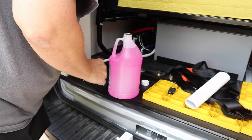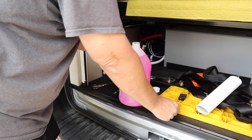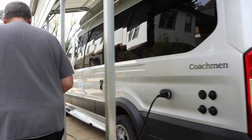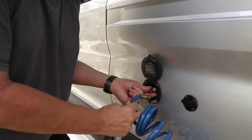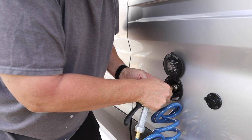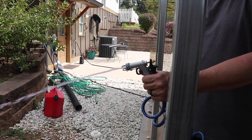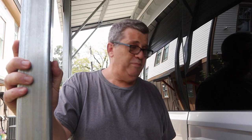I'm going to take a new jug and put about that much more in there. I got my shower hose — coming out here. The way you attach this is there's a little silver ring; you slide that ring in and push it into the quick detach chuck. Push it in like that, and nice pink water antifreeze is coming out. This is pressurized right now, so if I were to unplug it I'd get sprayed.